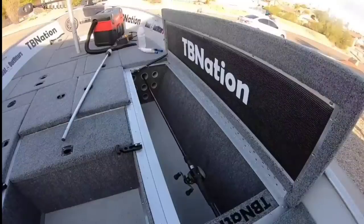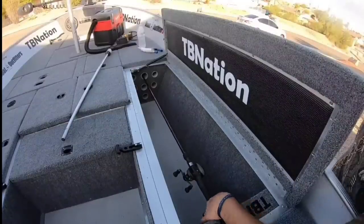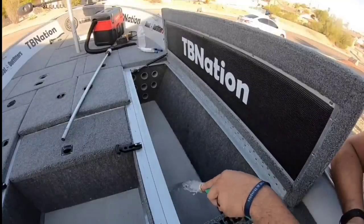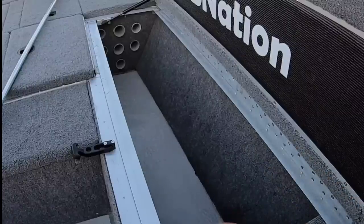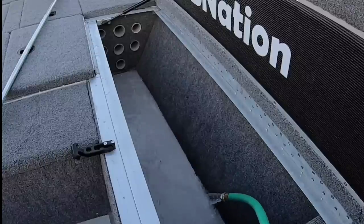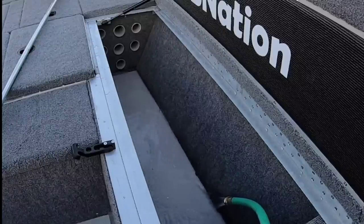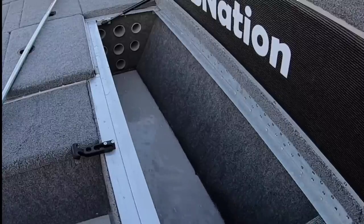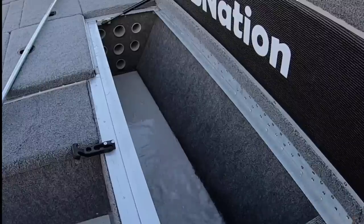Now we're on to test the other hatches. The dry hatches are one thing, but the bleed-offs — all the time we spent making that subfloor and having those drainage tubes channel toward the side — that was so any water that floods actively into the compartments would drain directly out of those ports. If that doesn't work, then we have a major problem. So we're going to flood this whole boat with water. This is the other reason I use gator skins, because no matter how much water gets in here, that stuff will remain uncompromised forever. I flushed it against the hole and that created a watertight barrier where I was able to channel all the water draining right through the gator skins, into the tubing, right into the center of the subfloor, and out to the bilge.